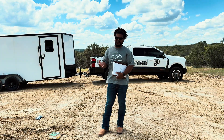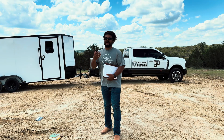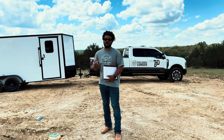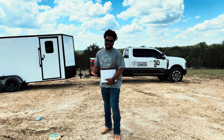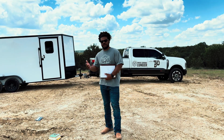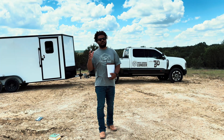If I have a clog, a break in a pipe, or any issues with my mechanicals under my floor, I can go under there and fix those immediately — a hundred times out of a hundred I'm able to fix those problems myself. I don't have to tear up my floor, I don't have to mud jack. If there's a squeak in the floor I can check it, screw it down, secure it. Pier and beam is a lot more forgiving on your joints, your back, in general.